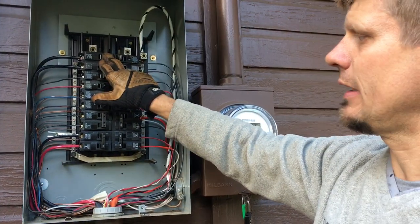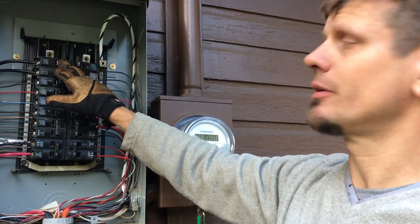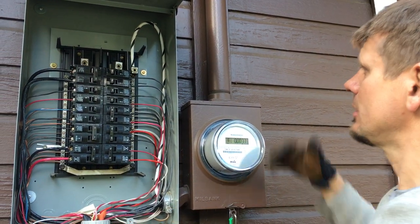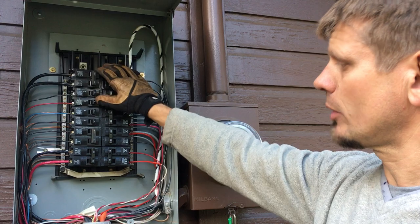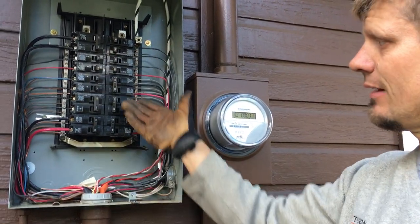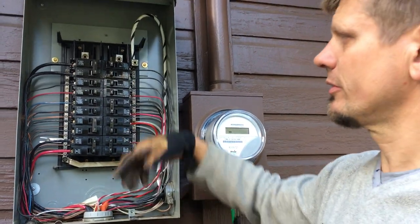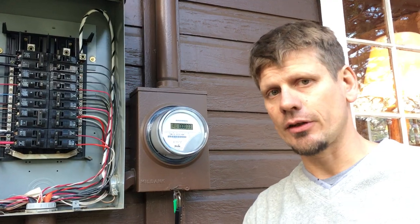At that point you'd have to upsize the service. You can't just upsize the breaker to 125 or 150 amps — most stab breakers max at 125 or maybe 150 in some brands. You'd have to upgrade the meter to a bigger bypass lever meter, bring in 4/0 aluminum wire, and put in a 200-amp main breaker, changing the whole guts of the panel. This panel is maxed out as it is — no breaker space left, and no molar teeth on the side for twin breakers. I'll show the practical side in my next video — thanks for joining us.